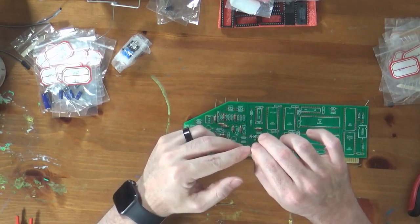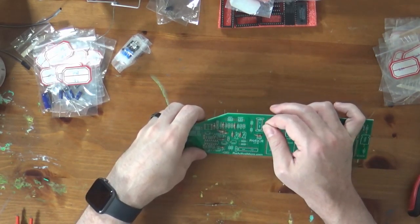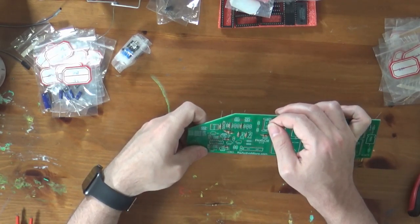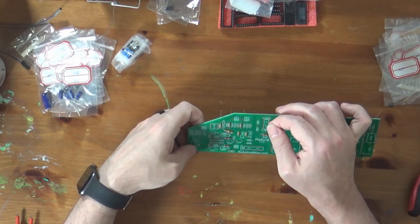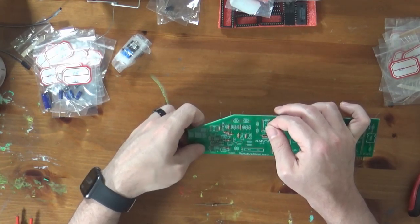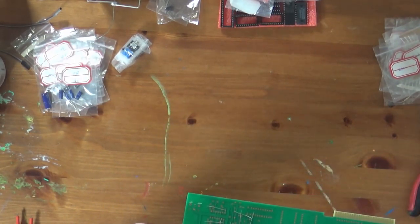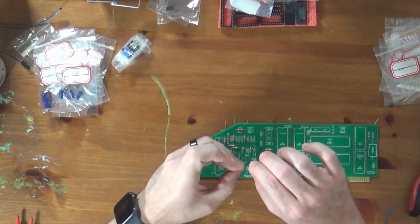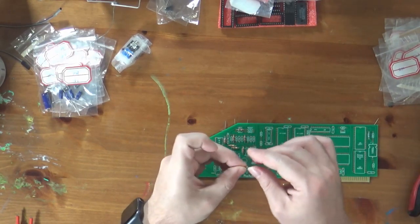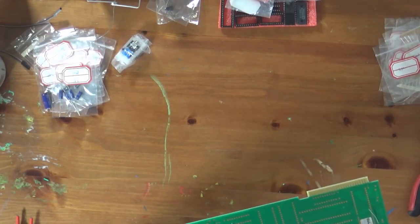But anyway, going back to my original point, the implementation of color on the Apple II: in order to save the number of chips used and to save cost, they use what's called artifact color. In all televisions, the initial signal that is broadcast is actually black and white, and there's additional data associated with it to give it color. Well, instead of doing that, what Steve Wozniak did was he decided to modulate the output in such a way that color will be generated as a side effect of the way the output was created. That's what we now call artifact color, and that's really neat. It caused some interesting issues later on. There were limitations as to where you could put certain pixels with certain colors on the screen, very much like the situation in the ZX Spectrum. But on the other hand, it saved a heck of a lot of chips and saved a lot of money for Apple. So it was really a very good design.